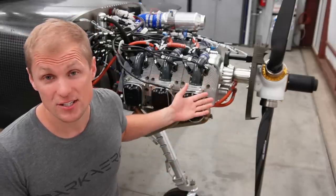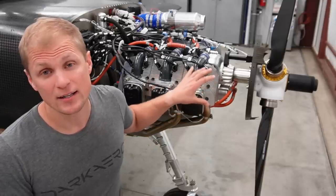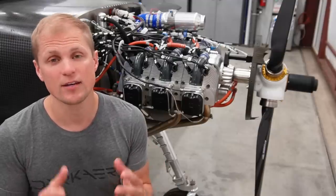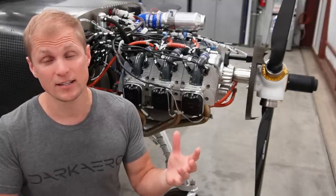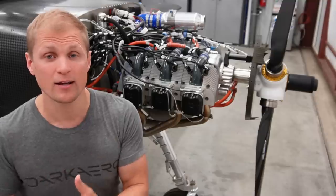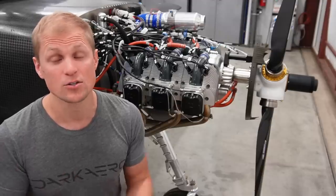Another big reason our airplane is light is that the engine is light — it weighs about 50 to 70 pounds less than traditional aircraft engines producing a similar amount of power. Since the engine forms a large portion of total aircraft mass, engine selection has a big impact on empty weight. An easy pitfall is to only look at power output and not fully consider engine weight. A heavy engine requires a stronger, heavier airframe, a bigger wing, a bigger tail to maintain stability, and stronger heavier landing gear — so selecting a heavy engine multiplies weight across the entire aircraft. On the other hand, selecting a light engine with a high power-to-weight ratio is a really easy win.